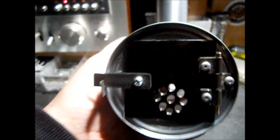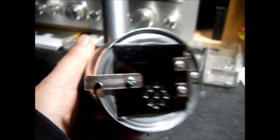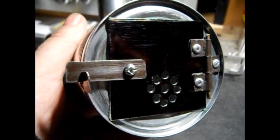Also, I'll show real quick, if you can see it, I put some washers under there. That helps pull that door back. See how that goes at an angle. It helps pull the door back tighter, because it was hitting up on the rim. It wasn't pulling it like it should. I think you get the idea. It puts more pressure down on the door. There, focus.